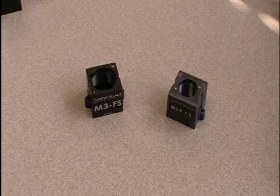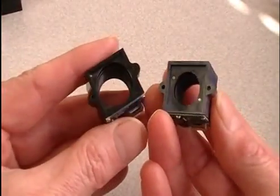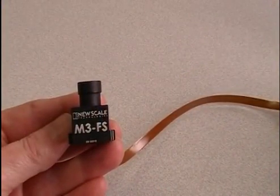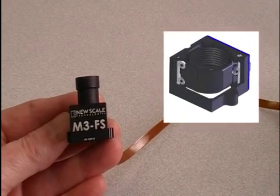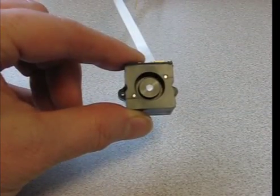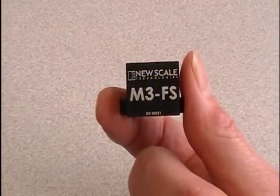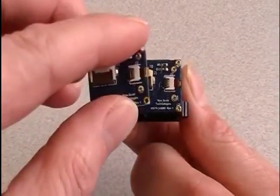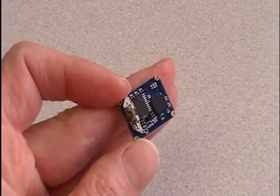The M3FS is backwards compatible with the original M3F — they have comparable mounting patterns and identical electrical and software interfaces. The new M3FS gets its accuracy and dynamic stability from its machined, anodized aluminum construction and an innovative zero-clearance ball bearing lens guide system. The original M3F focus module remains an economical option for less dynamic applications. Like all M3 systems, the focus module is a complete solution with everything built right into the module: a precision piezoelectric squiggle micromotor, position sensors, and all drive electronics for closed-loop motion.